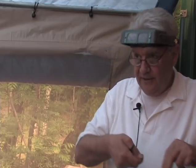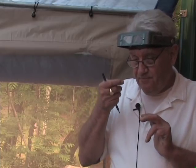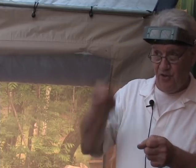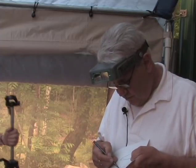Ken Hunt's method is that he takes his tool, he puts a face on it like this, and he uses an onglet. He doesn't use a flat-sided chisel. He usually uses a stone, and he'll start up towards the upper part of this, and he'll roll the chisel, but he goes slower as it gets towards the point, so there's more sharpening going on there than further up on the chisel. And so when you're done and you look at the chisel from the side, you see something that looks almost straight up and down.